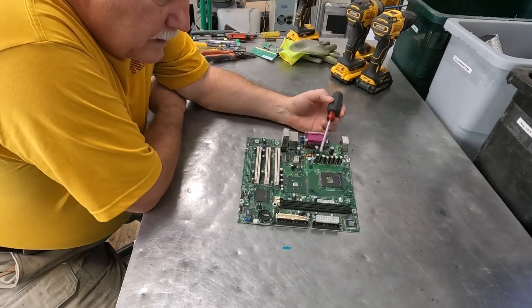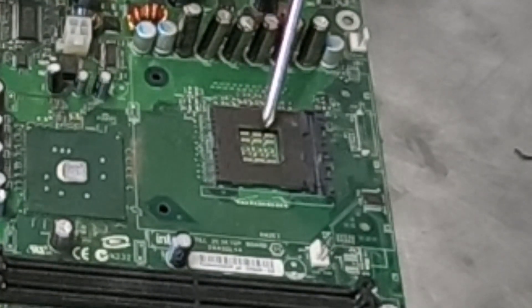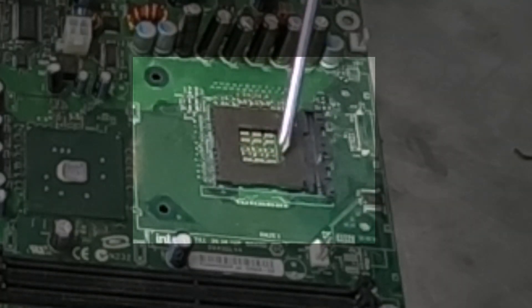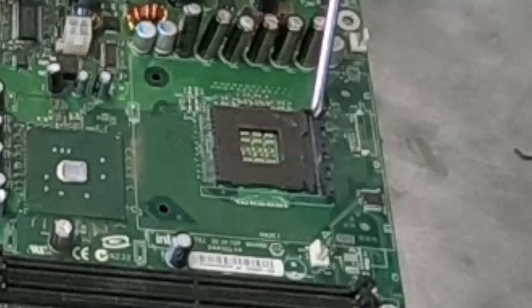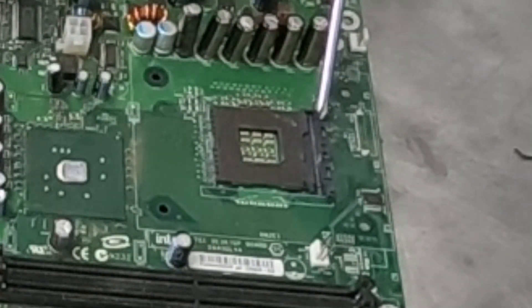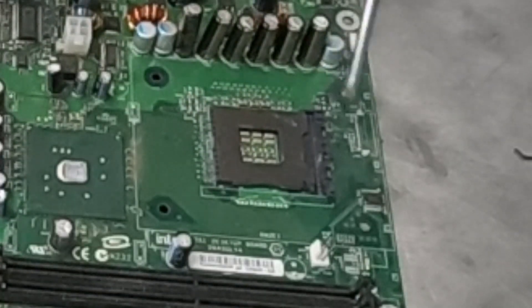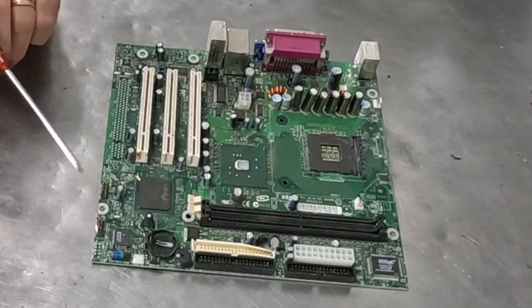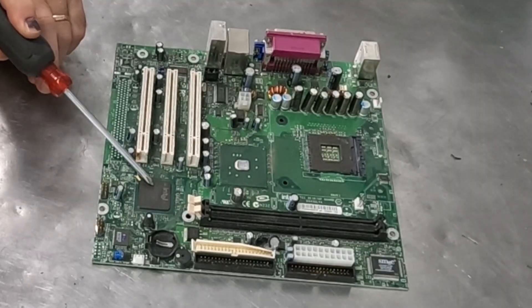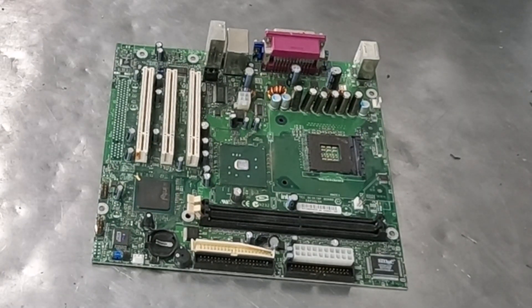This second board is a little more difficult, but let's talk through it. The first thing we look at is the socket — it appears to be more square than the previous one, a little bit smaller. We might have a hinge mechanism here for holding the CPU in place, but it's been damaged. It looks like the plastic hinge mechanism held the CPU in place, not a missing metal frame. The next thing we look at is the gold cornered BGA, which tells us this was an older kind of board — not an I series. A combination of gold cornered BGA and flip chip tells us this could be either a P4 small socket or a small metal socket motherboard in BoardSort.com's grading scale.